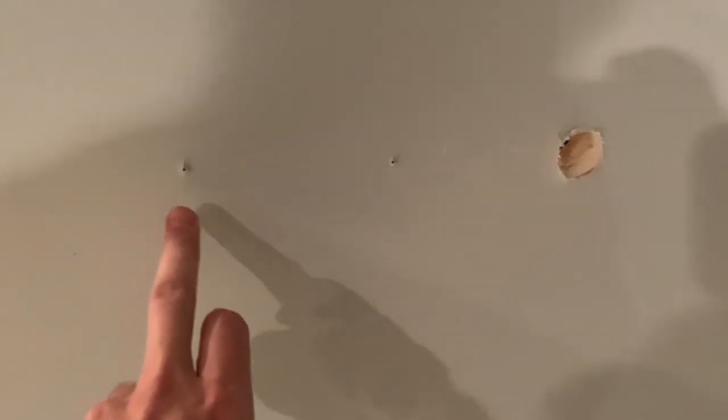Once the wood on the other side of the drywall is dry, go ahead and start drilling your holes for the shanks. My shank size is seven-eighths of an inch, and I have the holes punched through the wall so I know exactly where to drill from when we put the small nails through the drywall on the other side. This can get pretty messy, so put something down — I just have some insulation down to catch the debris.